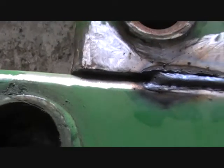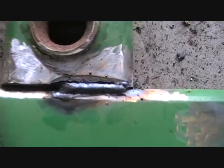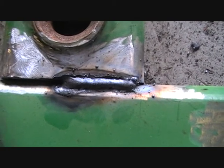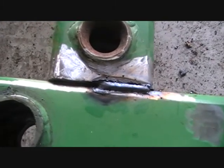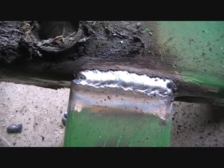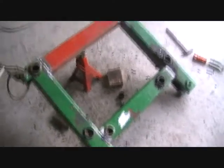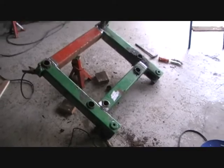When I have a big gap like that, especially when you're welding two bits of box together when you have the rounded edge, what I like to do is just put a small, thin bead — but a quite deep bead — just in along them first. I just stopped halfway along there because I ran out of rod. And once I have a thin bead across bridging the two pieces, then go across and put a wider bead across it again on top of that — that really stitches both of them together. I've always found that makes quite a strong weld for me anyway. I'm not sure if that's the way they do it in the industry, but that's how I do it.